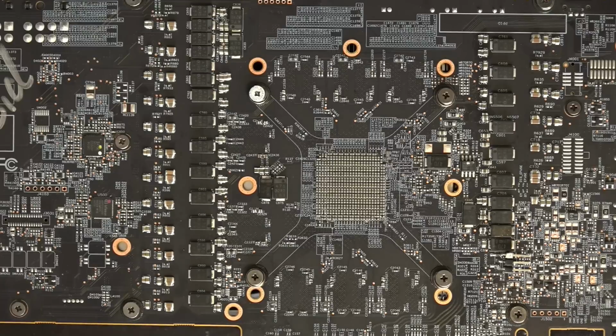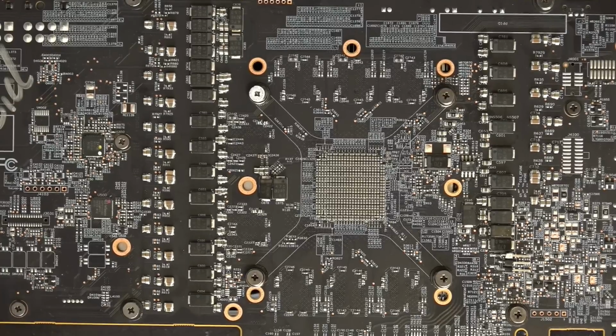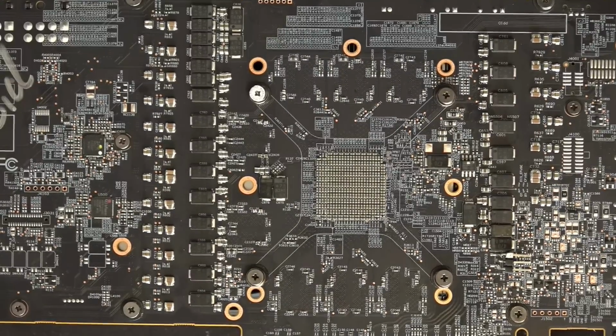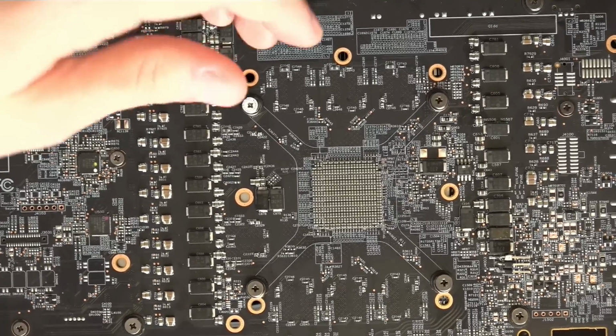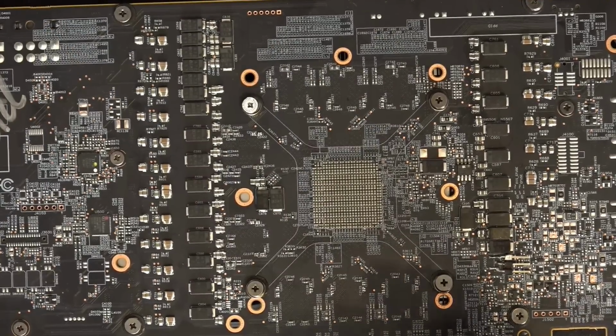Anyway, the memory overclocking situation is interesting. For benching, all of my top scores are at 2180 on the memory, which is the highest memory clock I've seen anybody bench one of these with and still get good scores. I can go up to 2200 without crashing, well, sometimes. That's the funny thing: 2200 sometimes takes out the drivers and sometimes it doesn't. If I go up to 2200, it'll definitely perform badly unless I'm at low core clocks. So I'd say the caps are mostly responsible for my ability to bench 2180.